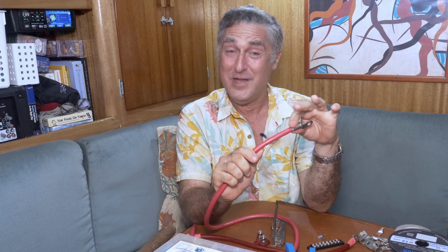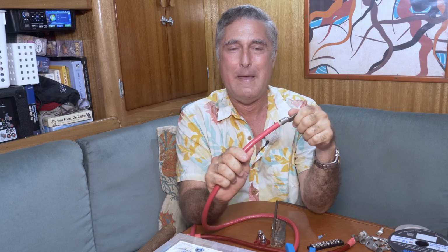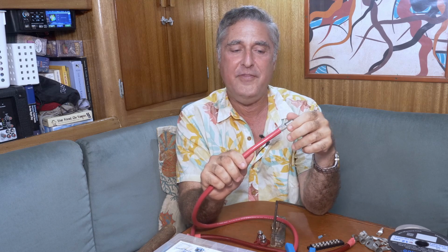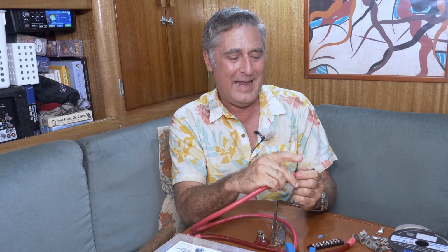This is copper, it conducts heat really, really well. Well, that copper will get super hot. And the super hot will melt the solder, and you don't have a physical connection once the solder is melted. And melted solder is just like water. Bang, same thing. So always, always, always make a good, strong physical connection. And then add the solder if you want to. It may be necessary for your peace of mind. It's probably a good idea, but honestly, I don't find it terribly necessary.